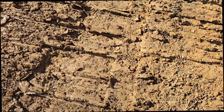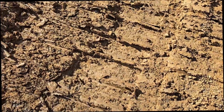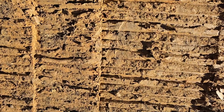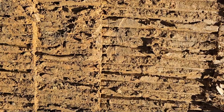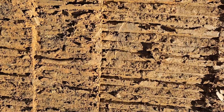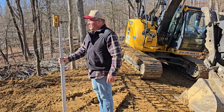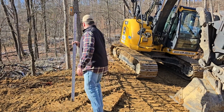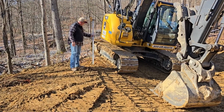Here's a close-up view of the wetland basin that has been compacted using the tracks and weight of the excavator. One can tell that the soil is compacted because there are no sharp ridges or drop-offs along the edge of the excavator track marks, and because we were not able to make deep divots using the heels of our boots. John Utterback uses a laser level and a receiver to check elevations along the length and width of the spillway being made for the new wetland.